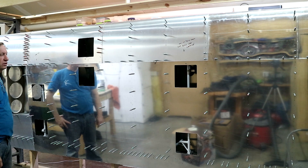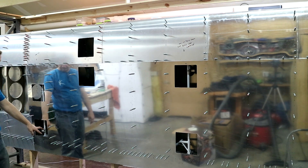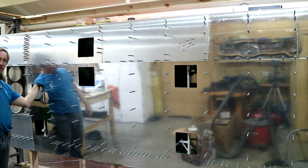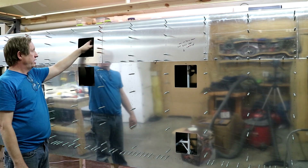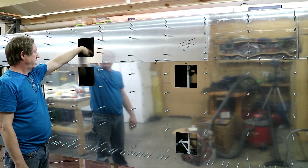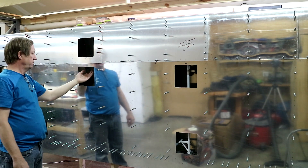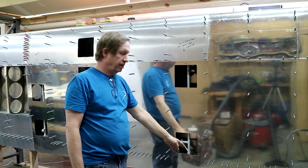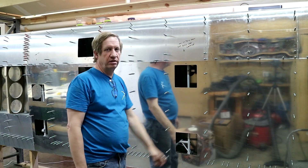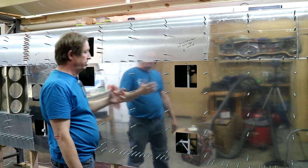So that's the six inspection covers — or the holes for the covers. Basically the flap arms, the flap springs, plus the top of the flap support here to get to the bolts. The pitot tube will be in here, and the strut mounts right here — the steel bars. And over here is the aileron pulley and the actuator for the aileron. I will cut the rest of these covers out on the CNC router so they all fit to the holes, but all the holes are identical.